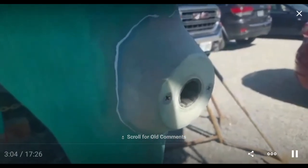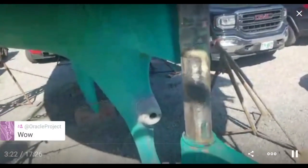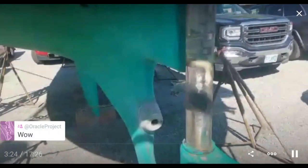Well, the trouble is, with this boat, straight back is the rudder. Well, that's no good. So this rudder is normally, this is all the part that should be inside the boat. So it took a guy about a whole day of labor to disconnect the parts that are up inside, and then this whole thing came down. You can see where it's resting on the ground on a little block of wood. So if this thing dropped, then the shaft can come out.